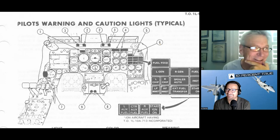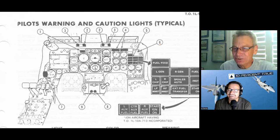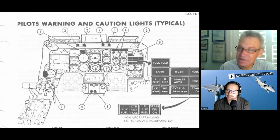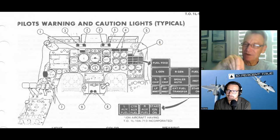I tried that one other time and it worked — it's amazing. These two left-chip and right-chip lights are two of the scariest lights you could have in a turboprop airplane. There's a magnet in the oil pan, and if it attracts iron particles it bridges the gap and turns the light on. That's bad.